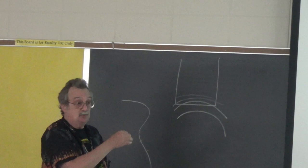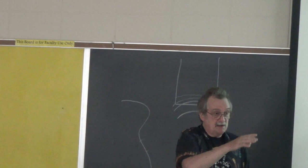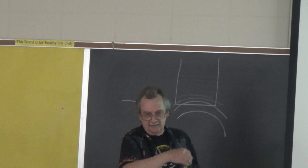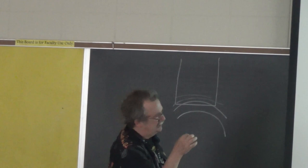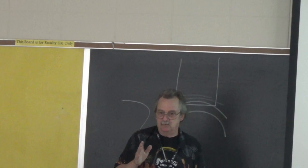And as I'm dropping this in, I'm using Titebond, and I'm working about 6-8 inches at a time. This Titebond will start setting up reasonably quick. Try not to wipe so much with the grain, dab it, wipe across, get the worst of the glue up. And I've made myself a little tool, I don't think I showed it here, just a 6-penny nail, sharpened like a needle, and that way I can manipulate the pearl in that trough so that I can close up any joints that open up for me. All right?